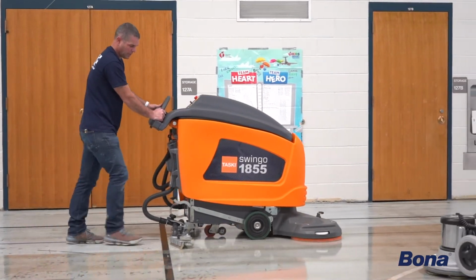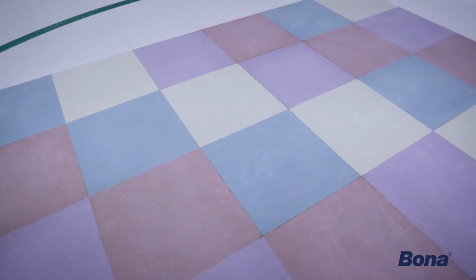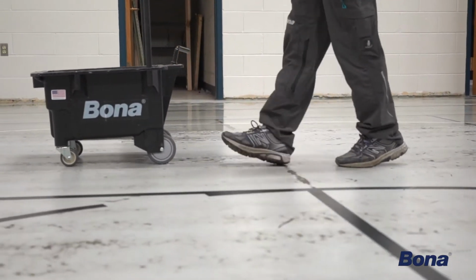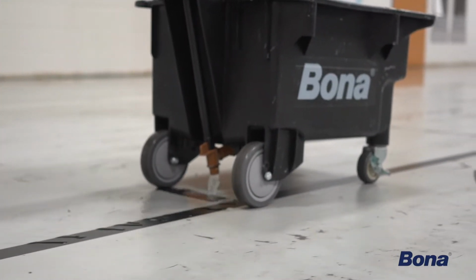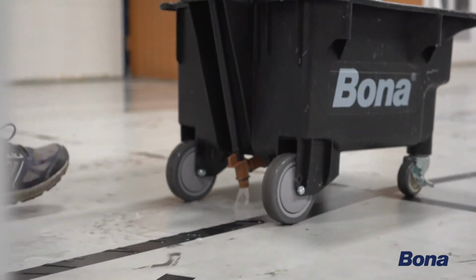Once the wet abrasion process is complete, examine the floor for any remaining polish. You can abrade these areas with a clean and dry Flexi Sand Buffer, multi-disc, and diamond abrasives. Rinse the floor thoroughly with Bona Commercial System Hard Surface Cleaner to neutralize any remaining stripper residue.